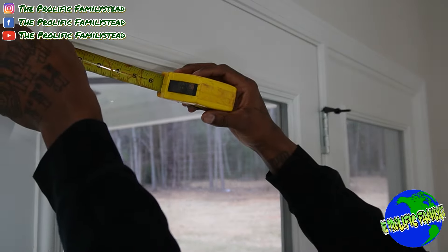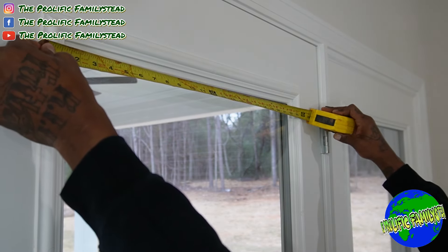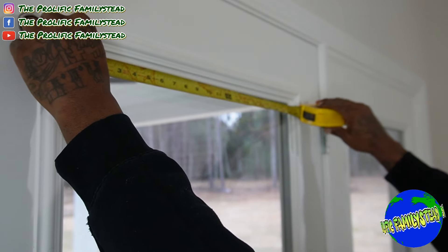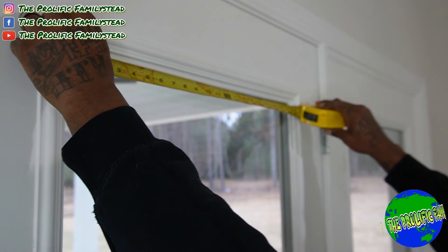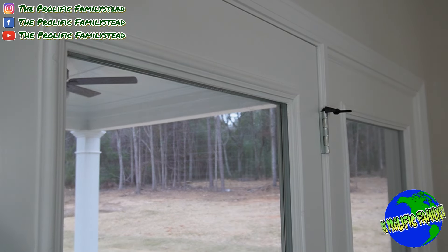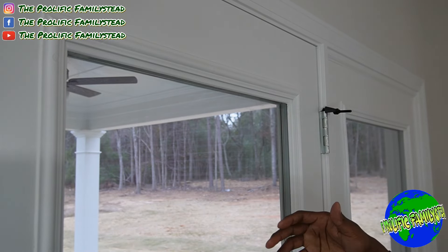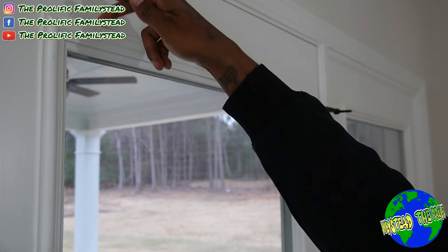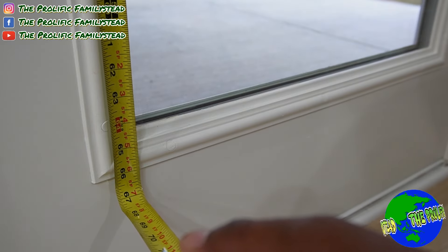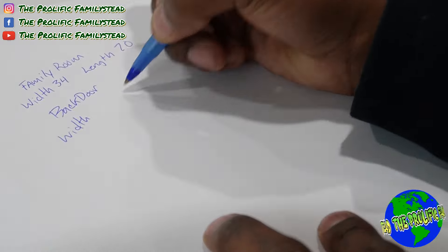This window is 70 inches long. A quick tip: if you're measuring blinds for your door, you want to measure from the outside edge to the outside edge — which is 24 inches. Don't measure just the inside opening, which is 21 inches, or your blinds will be too small to cover your window. You want to measure from there to there, and for the length do the same thing from top to bottom.